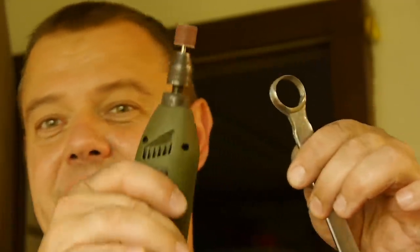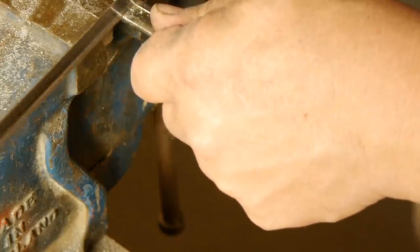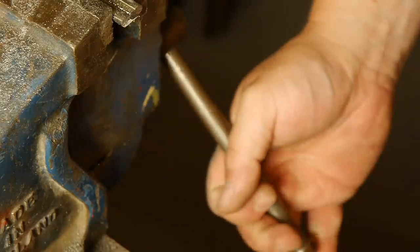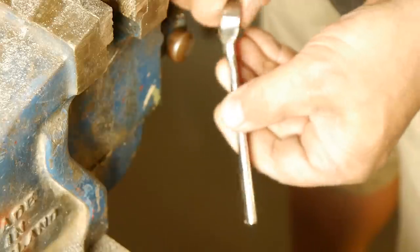Another 10 minutes later I am done with the micro drill. Now I make a sharp edge with sandpaper by hand, but first I have to shorten it. Sadly I don't have a big sandpaper collection — all I found was 1200 grit and 600 grit sandpaper, and the rest was far too coarse. So let's try it with the 600 and 1200 and we will see if the result is good enough.